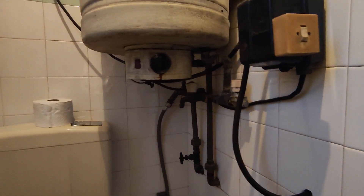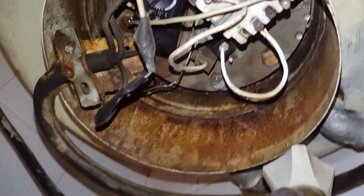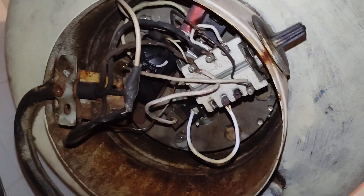What needs to happen — I will show you. The heater is actually leaking. This heater is leaking right next to the electrical connections, and you can see it leaks from right there. So what I am going to need to do is take all the cables out.